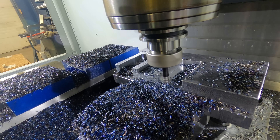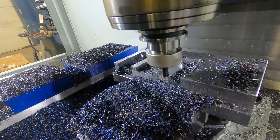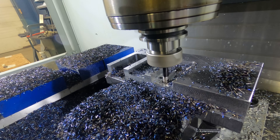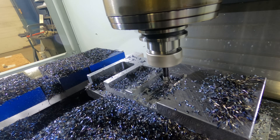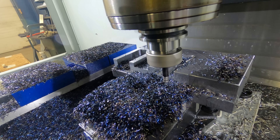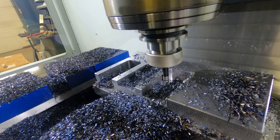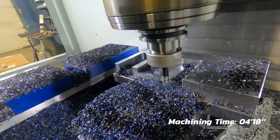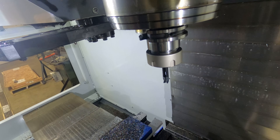We can see we're going into the last pass, going right down to three-quarter inch. You can see that this is a far faster approach than the trochoidal milling toolpath. Now the concern - one of the advantages of the adaptive clear or dynamic milling approaches is it depends on the material. For a nice cutting material like 1018 steel, aluminum, or copper - something soft - this is a great way to get it out. When it comes to something super hard like Inconel or Hastelloy, you may have to use something like those radial chip thinning toolpaths to keep from work hardening the piece. In our case here we're not really concerned about that and all the heat's coming out anyway. We're cutting this dry just with air, so you can't draw too many conclusions with something like Hastelloy.